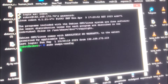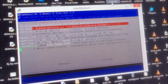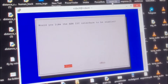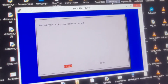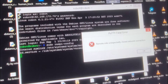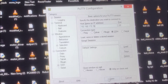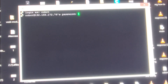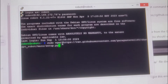Open up Raspberry Pi configuration. Go down to Interface Options and turn on Legacy Camera. Then Interface Options again and turn on I2C. Then reboot after that. You'll get an error message because the computer shut off, so go ahead and close out of the window. Give it about five minutes to reboot, then open it back up in PuTTY with the same IP address, log in, and type in this really long command — I'll put it down in the description so you can just copy and paste it. That'll download the setup script.